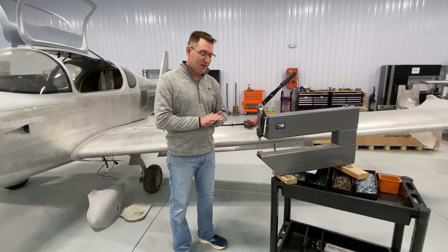The second portion comes down to your rivet gun — more specifically, the actual mandrel on the rivet gun. The countersunk rivet has a head diameter, and you want to make sure that head diameter matches the diameter of the mandrel on the rivet gun. If the mandrel is larger, it's going to sit and overshadow the rivet dimple hole, and it's going to pull the rivet head out of the hole.